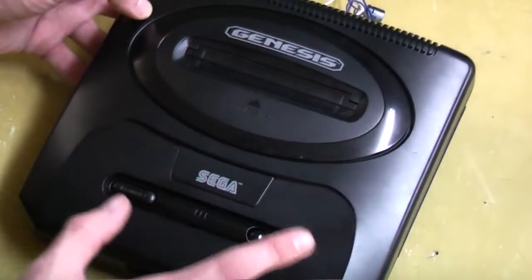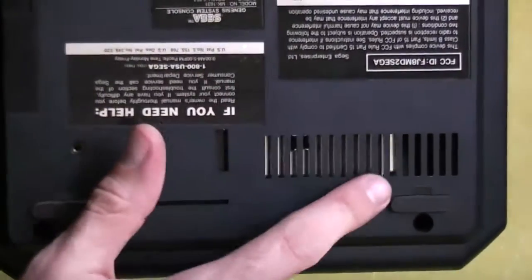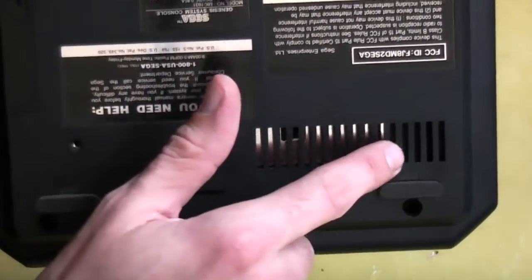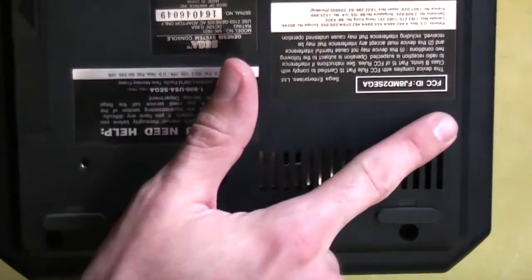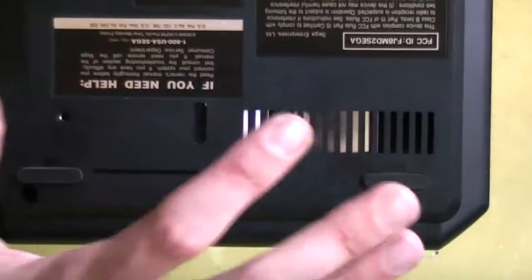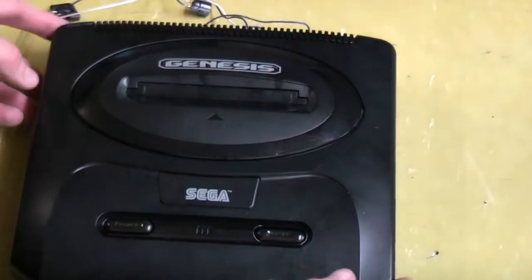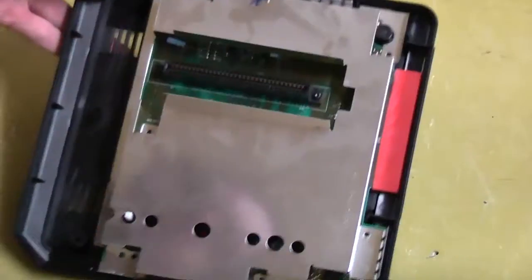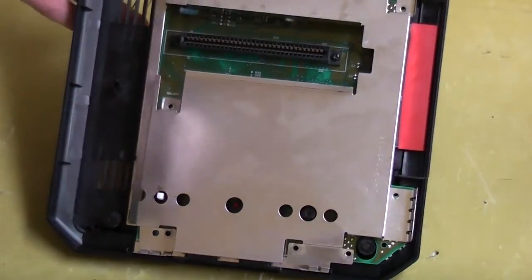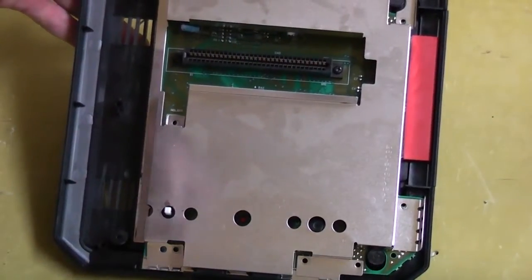You can tell you've got one of these by looking on the back of it. You can see the shielding in here — how it doesn't go all the way across. All Mega Drive 2s go right the way across, and most Sega Genesis 2s also go right across as well, but not this one. I'll just pop the lid and show you. You can see where it gets its three-quarter name from — it doesn't fill up the whole housing. It's three-quarters the size of a regular Genesis 2 motherboard.